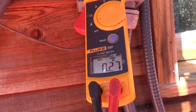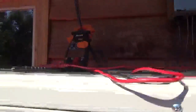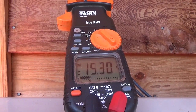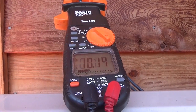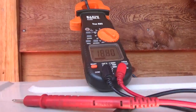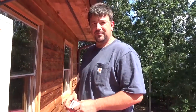Let's look at the DC side — shooting over to the DC meter now. We're back up running about 20 to 22 amps. The meter keeps resetting but believe me, we're getting at least 600 to 800 watts on the DC side and only about 64 watts on the AC side. Great day for testing — really hot roof and great solar conditions.